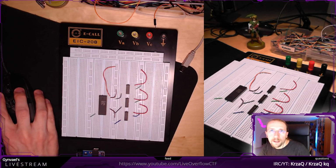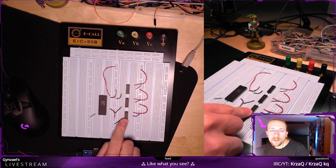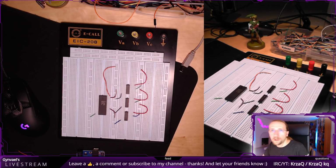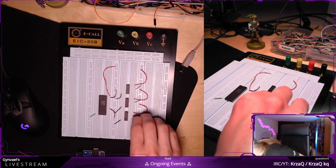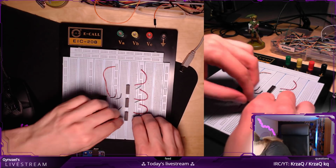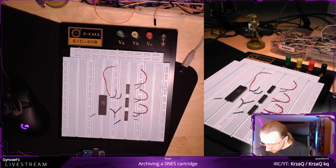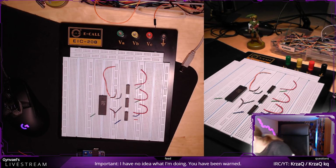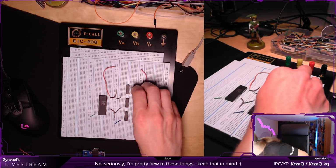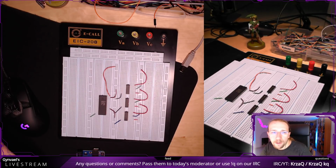Perfect. Now I had to tie the serial clear to VCC, which would be pin 11. That's in all of these 3. That would be 3rd from the bottom on the right. And I do need to tie it to high, high as in VCC. 3rd? No, 3rd. No, wait. 2nd. It's 2nd. Okay. So 2nd tied to power. Then 2nd tied to power. And one more 2nd tied to power. Okay, that's fine. So I have these now.